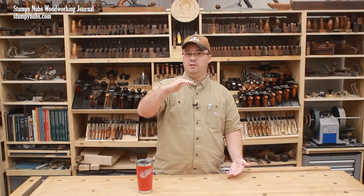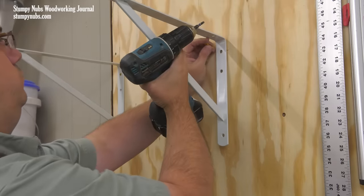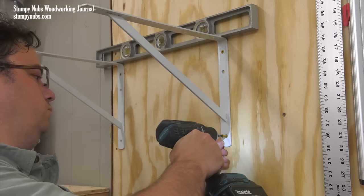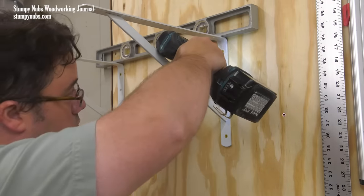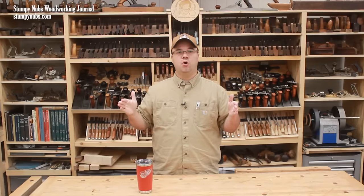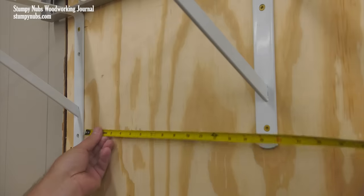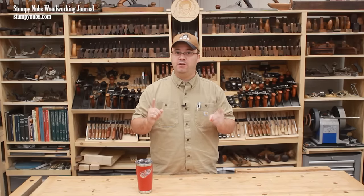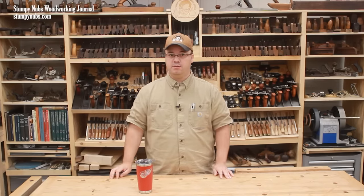Find a location to mount your box on the wall. Remember, you'll need room beneath for a 3-foot filter plus a collection bag, so I suggest mounting your brackets about 5 feet above the floor, depending on the size of the collection bag you intend to use. I made my box wide enough for my brackets to go onto wall studs, which are usually spaced every 16 inches. Make sure the inner edges of the brackets are at least 14 and a half inches apart if you plan on mounting a flanged filter rather than using the screw-on filter mounting method.